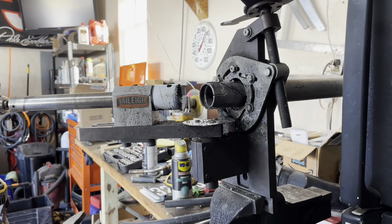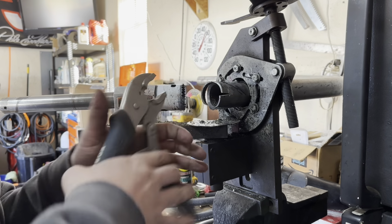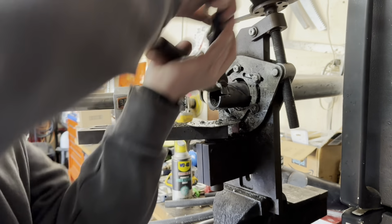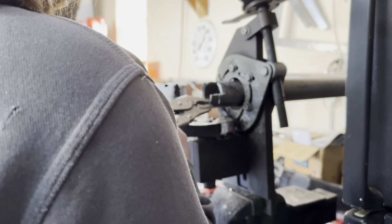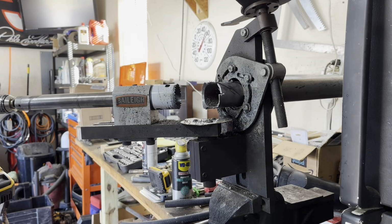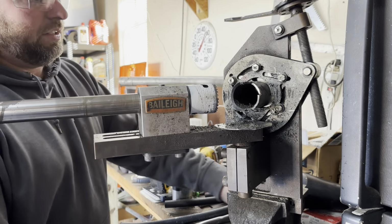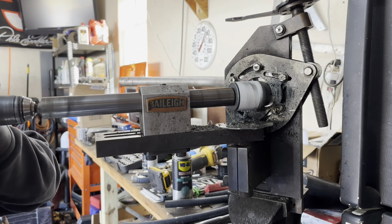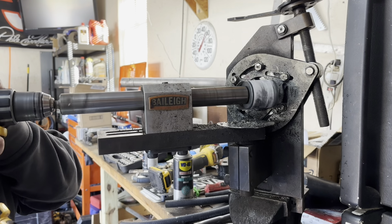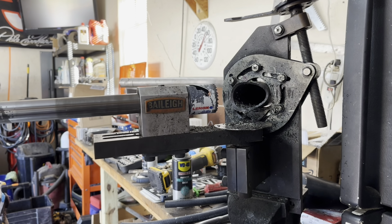To do is score these things and then come in and basically use a pair of vice grips to get the damn thing off. Like so. There we go. And now we can keep on pushing forward with the notch. So, you want to prevent that, get yourself some deep hole saws. There we go. Nice clean up.